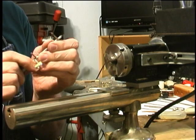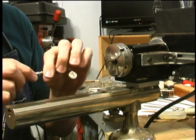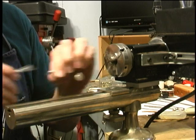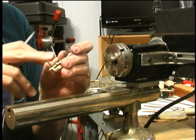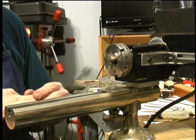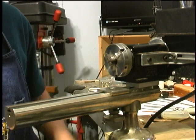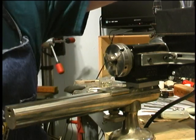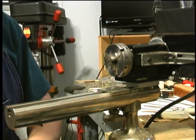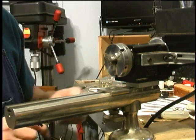The pumice stone continues to break down into smaller and smaller particles. One problem with lapping grit is it tends to stick in the key and continue to wear on the rod over the years, but the pumice stone breaks down more and more over time. And so it has a little less of a continuing to abrade the parts effect on it.